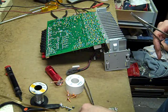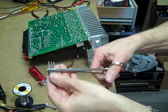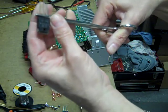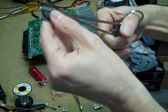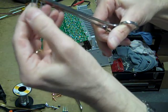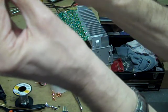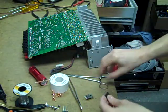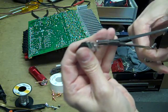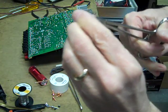I have a little trick I use for forming the leads on the output transistors. I have these fat hemostats — I line them up, try to make it a straight line, clamp them, and bend them. Then do the same thing again: straight line across, clamp and bend. That gives me pretty much the same kind of bend as the originals — pretty close to the original.